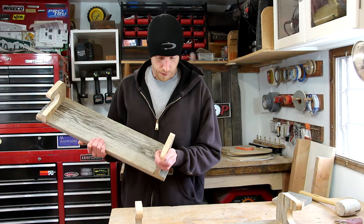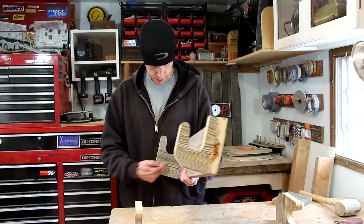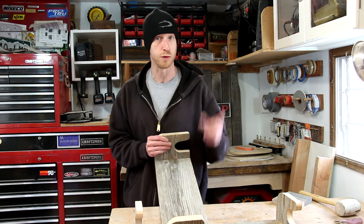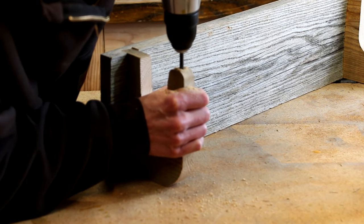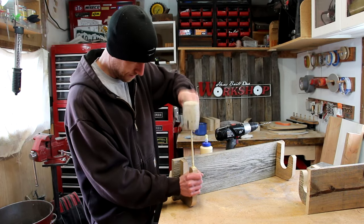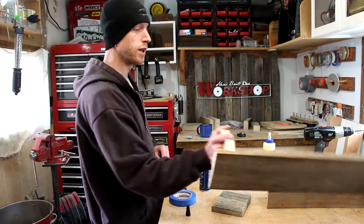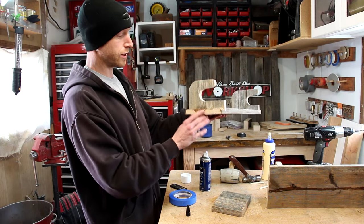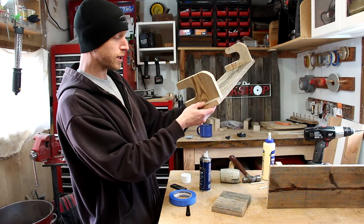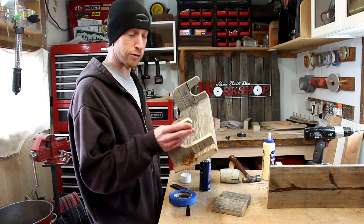I noticed when I was unclamping these that the top piece on this board has got a crack. I didn't notice it when I cut this out. The crack runs right to the bottom of this cutout, and I can actually wiggle that piece of wood and see the crack open up, so I need to take care of that problem first. Since this portion is going to be covered by some felt when it's all completed anyway, I'm going to drill a hole straight down into the crack and insert a dowel and some wood glue. Hopefully that will give it the support it needs. That's kind of the problem with using barn wood — you've got cracks, some of it's dry rotted, and I've even got a little piece here with worm holes. You just got to be a little careful with the wood you choose. A little bit of repairs and some reinforcement I think will be just fine.